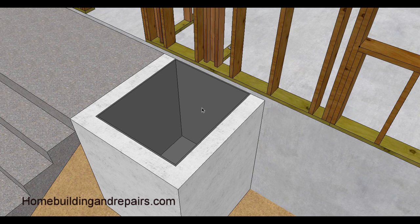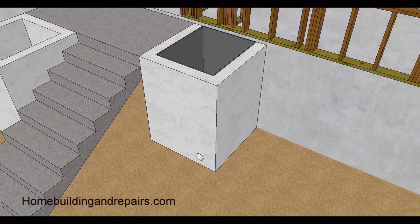The reason I'm making this video is to suggest lowering the level of the soil or fill material to reduce the amount of moisture, if you really want the planters. You're going to need a drain hole if you have a concrete floor or something water isn't going to seep through easily. You do not want it to pool up in there because that creates even more problems and allows moisture faster to go into the concrete. Drainage is essential on anything you seal with concrete or other materials on the bottom.